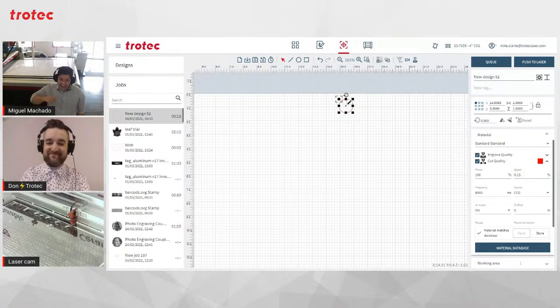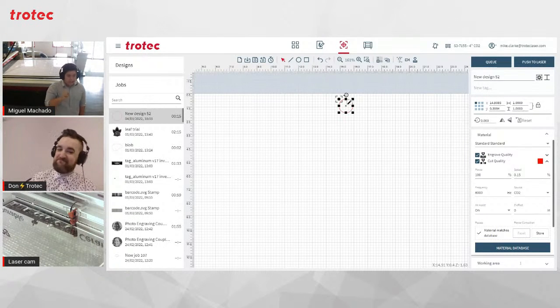And again, I gotta say, do not do that. But the process of cutting acrylic releases a gas that, with the laser, will flame up. So with enough time cutting the same acrylic, it will flame up. There's no way around it unless you're doing 3 millimeters. But if you're cutting thicker acrylic, it will happen. Because that is an inevitability unless you have a major extraction system, it has to be amazing, or you have a 400 or a 360 that also has a vacuum table under it.